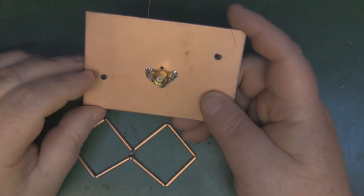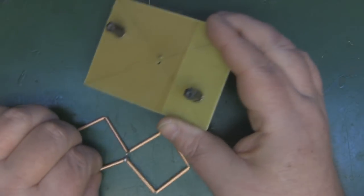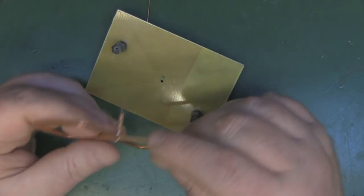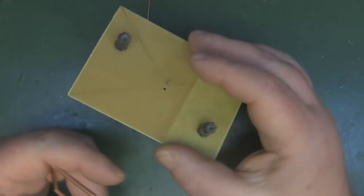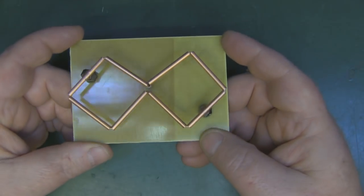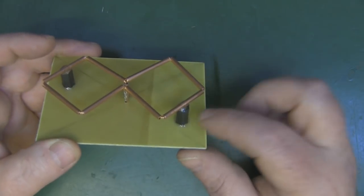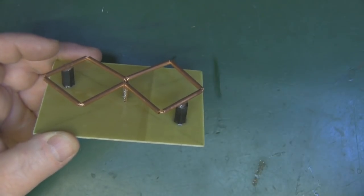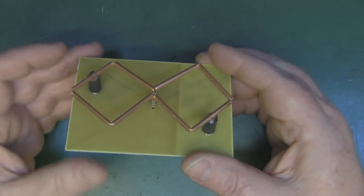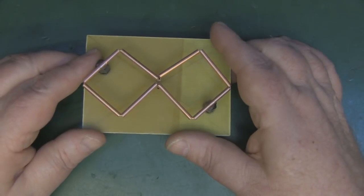The SMA connector is soldered on the back with solder run down the sides. I've pre-tinned the pin in the SMA connector and the copper tube on the bi-quad, then joined them with a little heat. The other leg solders to the back reflector. The bi-quad is now a working antenna. I've epoxied the elements to the little posts for support — if you don't have nylon posts, wooden dowel works well too. You just need something non-conductive like plastic or wood.